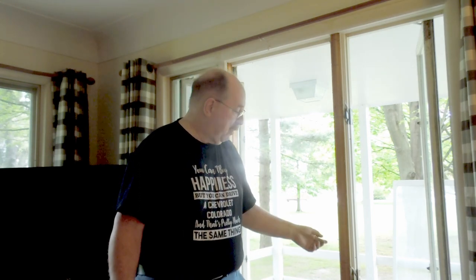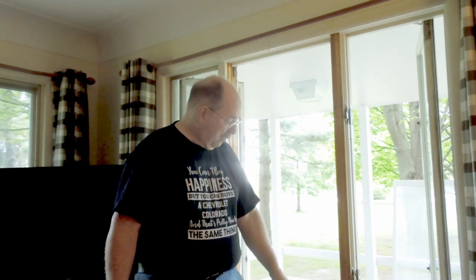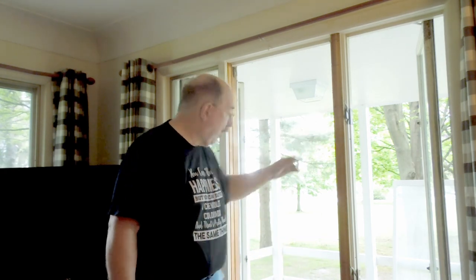Now, I hope this answers the question that people had about how do you get the window out of the frame. It's not easy. I had to pull the bottom piece loose, because the bottom piece traps the sides. Once I got the sides loose, then I could pull the nails by chiseling out the heads of the nails and then pulling them out with a pair of vice grips. Once I got the nails out, then I could put a chisel down in at the bottom and start prying that board loose, and then work my way up to the top and pull this sideboard off.